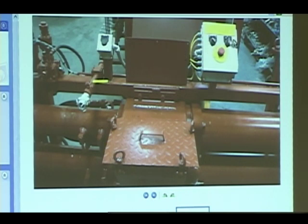And this is your forward reverse switch right here. So when you push that button, you have to turn that switch either forward or reverse, whichever direction you want to go, within a half a second of each other. So it's push and turn at the same time, otherwise it won't move. I've had customers forget this and call up, "Oh, it's broke, it don't work." They're just not doing it quickly enough. So just be aware of that. It's easily forgotten.